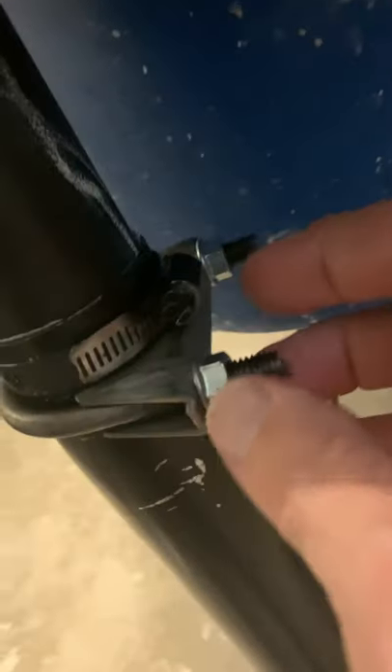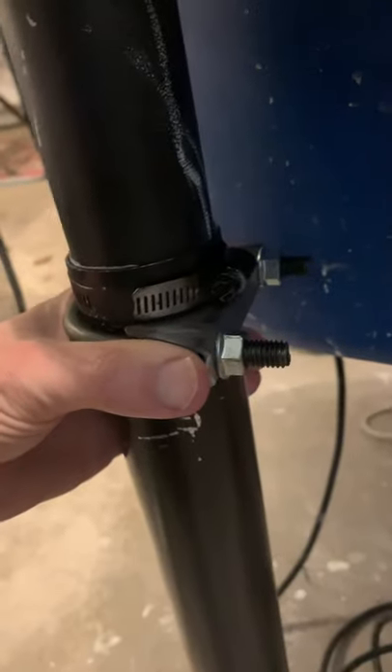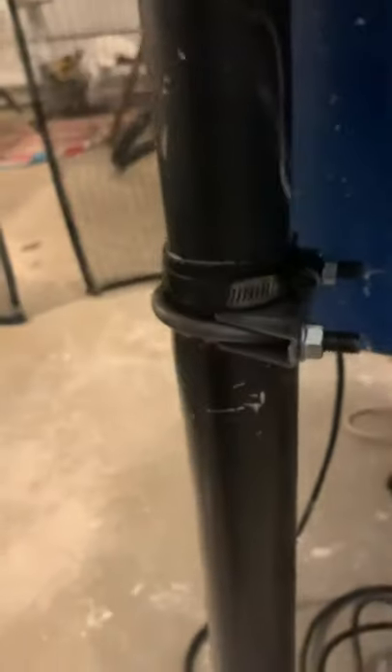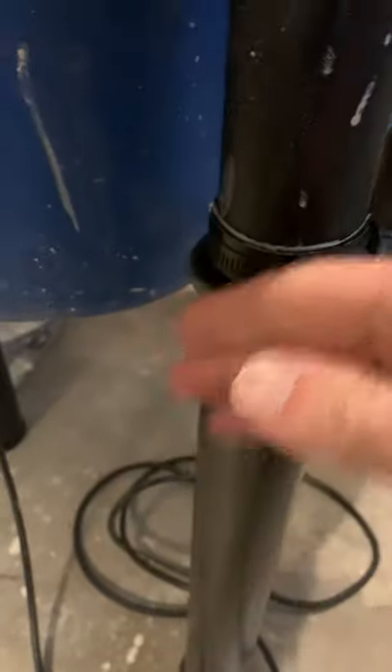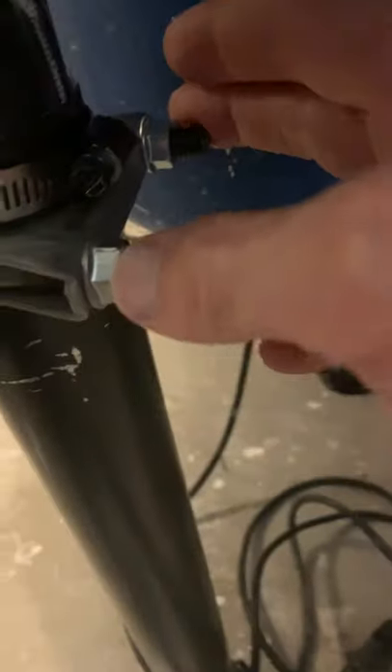Initially I used standard hose clamps from Home Depot, but that didn't work very well — I needed to squeeze just a little bit tighter than they could manage. So I bought two and one-eighth inch exhaust clamps at Advanced Auto Parts or Auto Zone. The pipe is actually two and one-eighth inches. I had to tap it on with a hammer, but then I'm able to use steel bolts to squeeze the fence post around the pottery wheel legs.